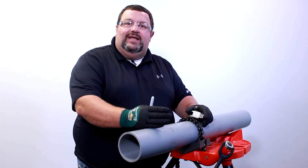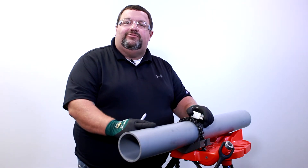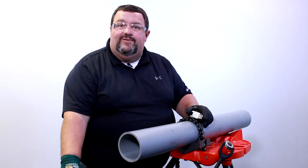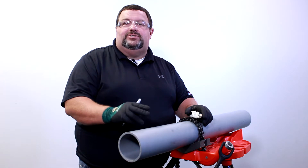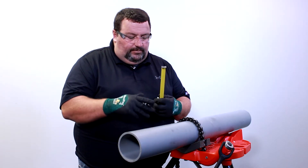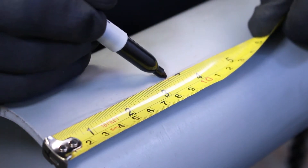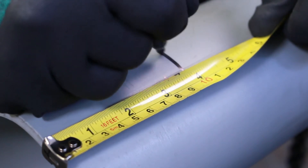The reasoning behind that is we want to be able to tell that we have scraped the pipe from the ground, or if we're looking down at a fitting. It's really important that the scraping be visible to an inspector. So my actual depth was three and a quarter, and I'm going to mark three and three quarters on my pipe to give me a guide to go by.